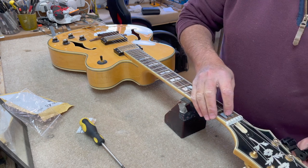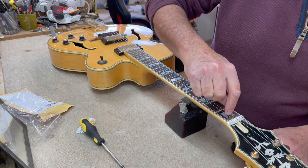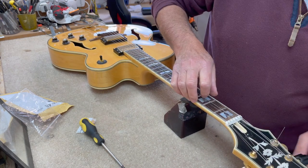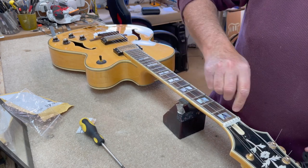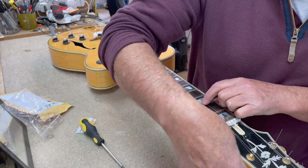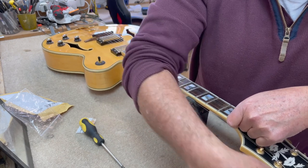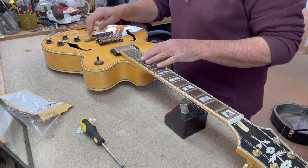So you can see under here, I'm making a big deal at the moment of this nut situation. You can see on this one, even where somebody's trimmed the edge of this shelf, it's caused cracking. I'm watching these little tag ends left over. They drag round and scratch the finish if you're not careful, so that's why I always cut them back. You can see where the edge has been cut or chopped and it's cracked, as always happens with brittle finish. It's a real challenge all the time, this thick brittle finish, and never more so than when they take the lazy way and put the nut in first and then do all the spraying, because you get all this huge build-up.